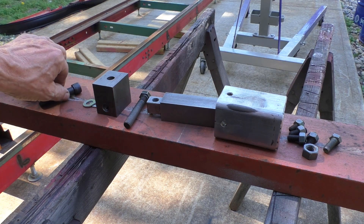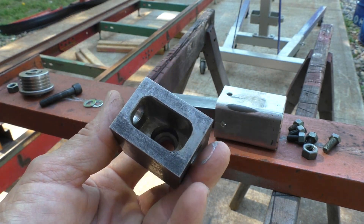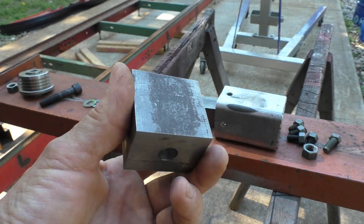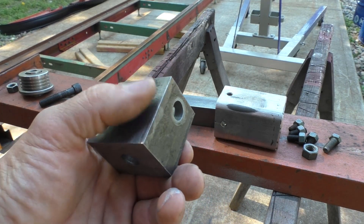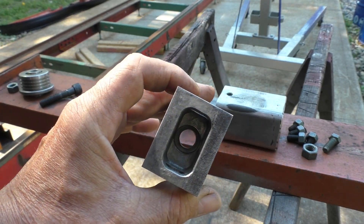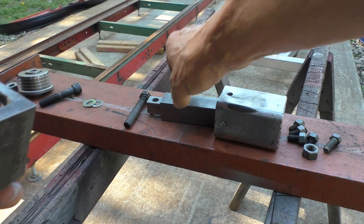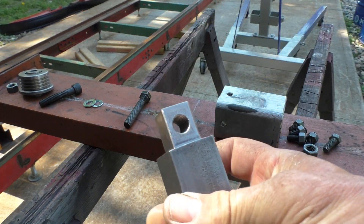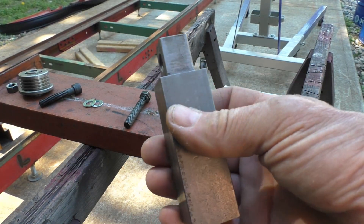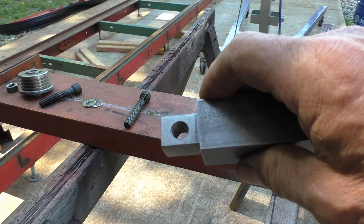Next, I milled out this block. It could have just been fabricated from some pieces of steel — I could have used a tube for the outside and put a metal plate on the end, or made it with plates for all four sides with a plate welded on the end — but essentially it's just a pocketed assembly for an adjuster to go into. I have this piece of inch-and-a-quarter bar, and again all this stuff is things I've been pulling out of the scrap pile — odds and ends. I drilled this and threaded it for a half-inch screw.